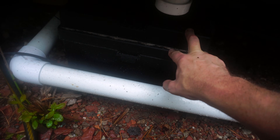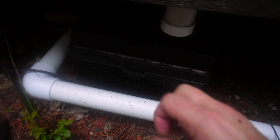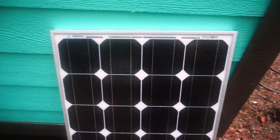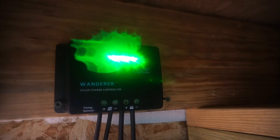The pump lines are just a positive and a negative, hooked up to a marine deep-cycle battery. That's what you want — it discharges slowly, unlike a car battery that's made for high starting amps. This battery is charged by a 100-watt solar panel from Renogy — I like them because they're well-established with good support. Underneath the trailer is the charge controller; you can see it blinking, which means it's not fully charged. This battery and panel also power the fan for the compost toilet.